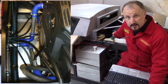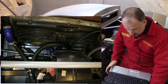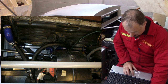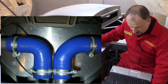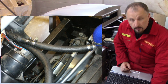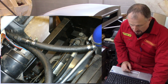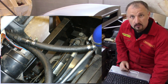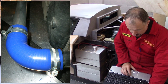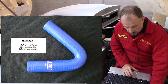There's the front of the engine again. And this is the hoses near the radiator — you can just make out the aluminium tubes that run along the bottom of the radiator. There are the 90-degree couplers connected to either side of the radiator, running down the pipes in the centre of the car. And there's that bleed screw referred to earlier, which goes into the blower system and the heater matrix. It's needed so when bleeding the system I can get rid of air on the blower side. And these are just some 90-degree silicon hoses at the bottom of the radiator — back to the 135-degree silicon bend.